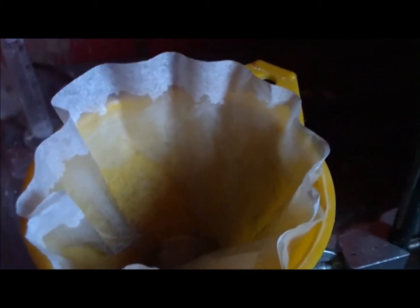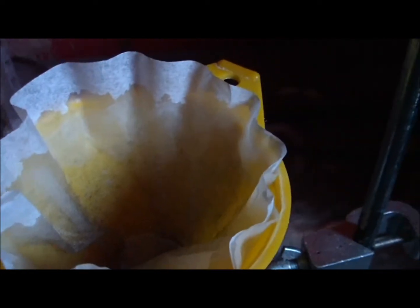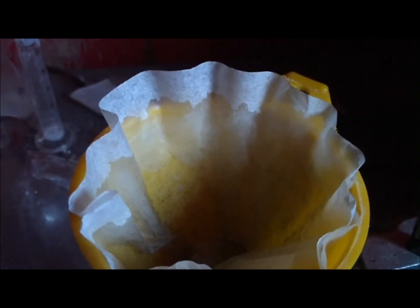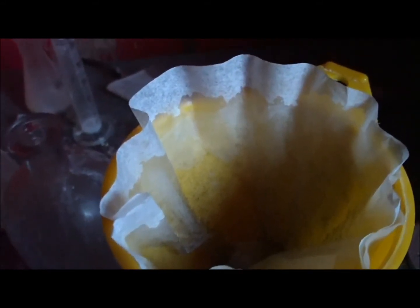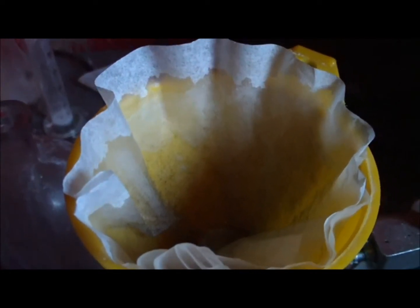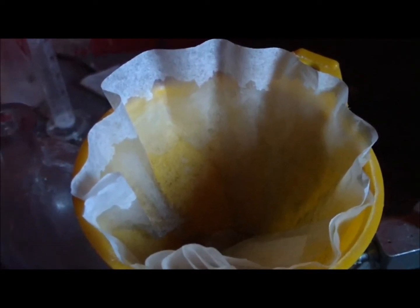The first time the filter was quite silver. Now some might say: well, you're filtering all the aluminum out. Well, that's not exactly true — we are actually just getting the extra particulate matter out. The solution has fully incorporated what aluminum is needed. We are just getting extra particulate matter that will be nothing but noise if it is left in the wax.